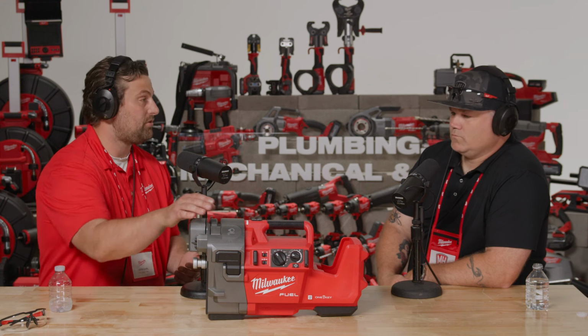The way that will work is that tool will fast follow this one. The expectation for this one is to ship in March of '25. That tool will quickly follow behind it. The biggest difference that you're going to see with that tool is obviously your UI, your pipe selection is going to be 2 to 6 inch. The second piece is it's going to have a larger lower roller. The reason why you lose 1.25 is the roller becomes so large that it doesn't fit the pipe.